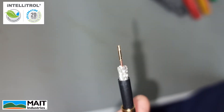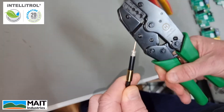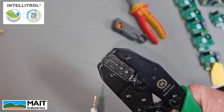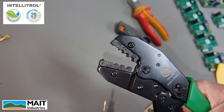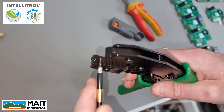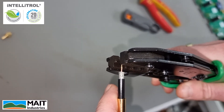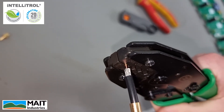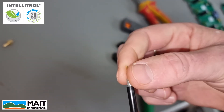At this point, we use our termination tool — it's a simple matter of using the topmost hole, which is the smallest hole. Open the crimps by pulling them together and insert our termination into the top hole, leaving the flared portion out of the crimp tool. Slowly take it down and crimp it all the way. That's now put our center conductor pin on.